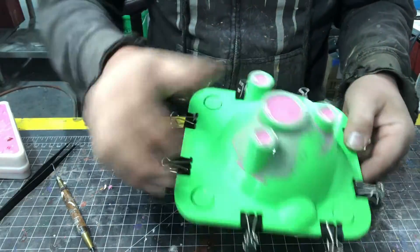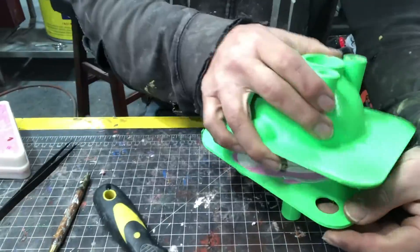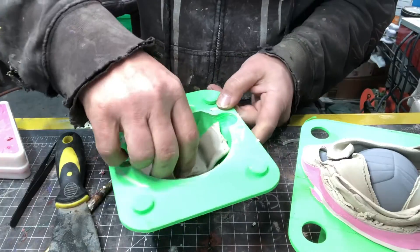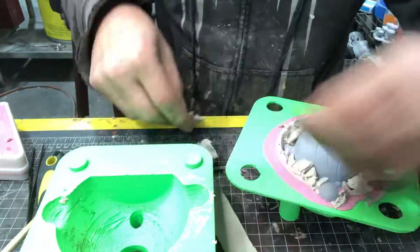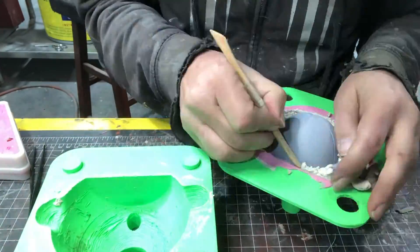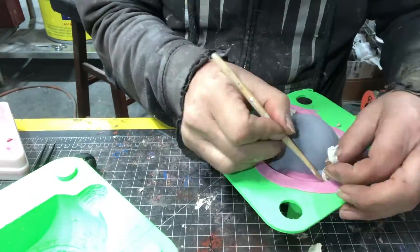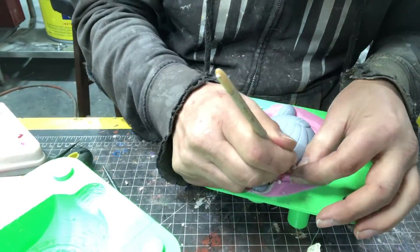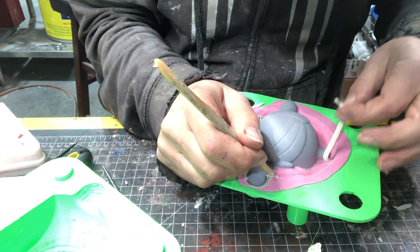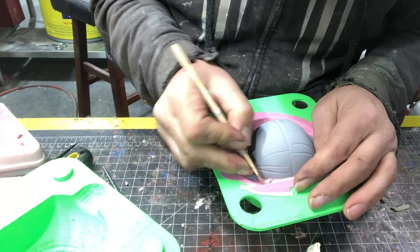After about 24 hours, the first half of the mold is set up and I can take off the backside and remove the clay I just spent hours working on. Make sure you get every little bit of clay out of there. I find this step is actually easiest in the winter when it's a little cold in my shop — the clay just seems to come out a lot cleaner. Notice the areas where I put the snakes are now little valleys that will guide and register the next piece.